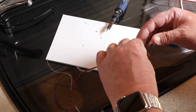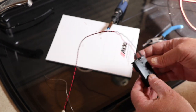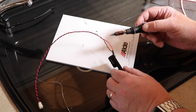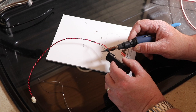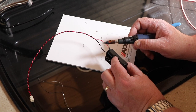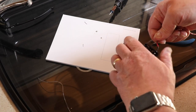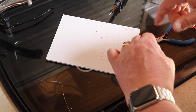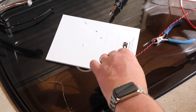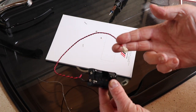We're just going to put our heat shrink over our terminals. And the beautiful thing — because we're using a gas soldering iron — you'll notice there's a heat vent at the side, so we can literally push that alongside and the heat shrink will now close up. And there we go — that is our battery backup now ready to install.